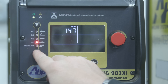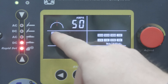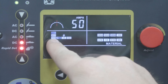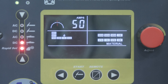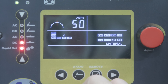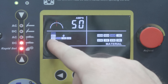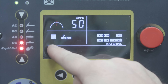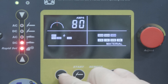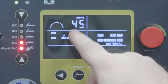Another cool feature with this new system is Rapid Set. If I open up the DC menu and hit Rapid Set, I get some different configurations — I can run 6011, 6013, and 7018. One thing I'd like to see that it doesn't have is 6010, but unless you're doing open root welding in the garage, you probably won't need that anyway. Most hobbyist and entry-level welders can get everything done with 6011 and 7018. I can also change my diameter as well as the type of electrode just by switching through here, and it presets my amperage automatically.